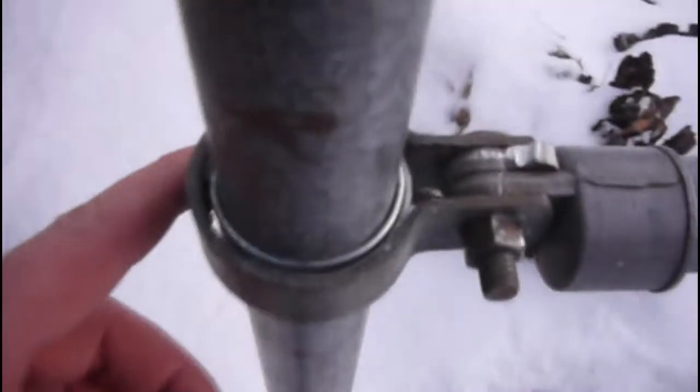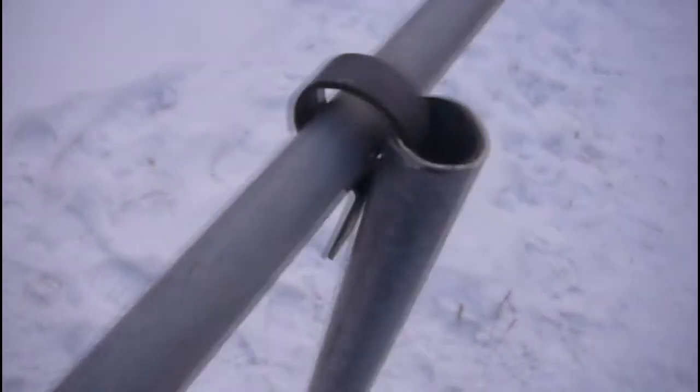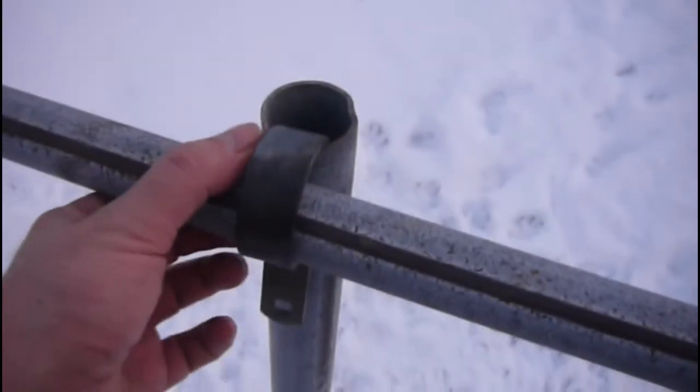Got this set. I had to do a little redneck spacer thing because this bracket was for a bigger post, so I put two inserts in it to get it pretty solid. I've got a little piece of fence that I'll be tying into my neighbor's fence later. I thought I had a four-foot fence, but in reality it's about three and a half feet. So the top rails I'm going to make adjustable once I stretch the fence — I'll know how much lower to set them so it'll be even. Then I'll cut the tops of the posts to match the height for the top rail.